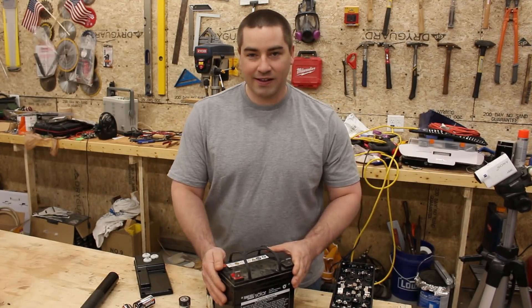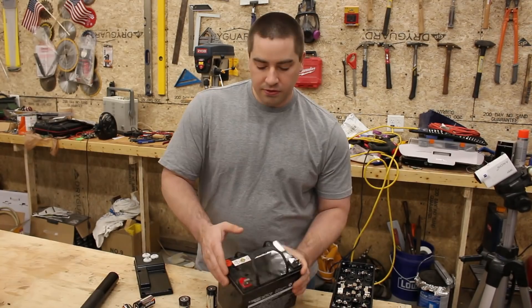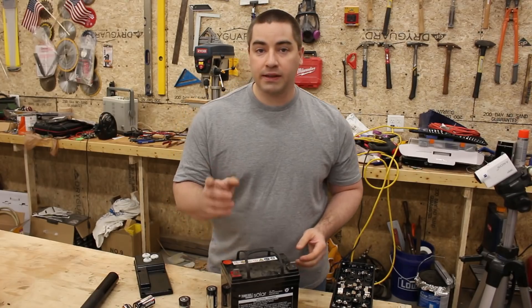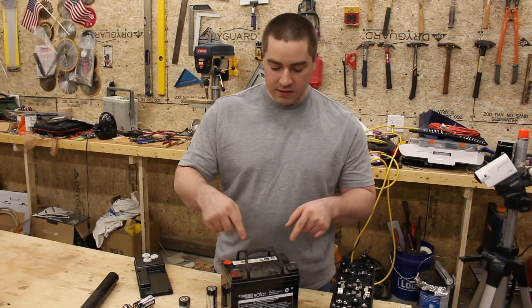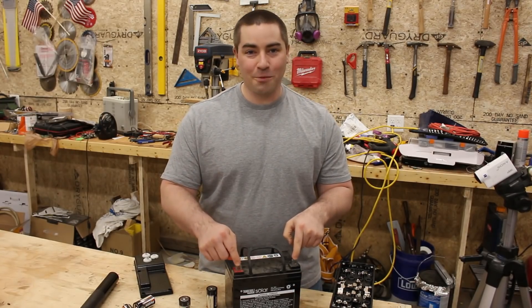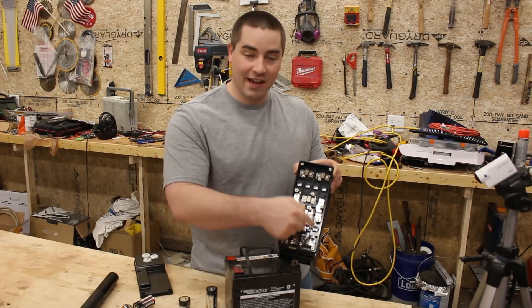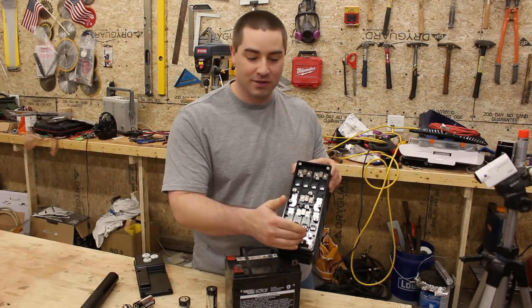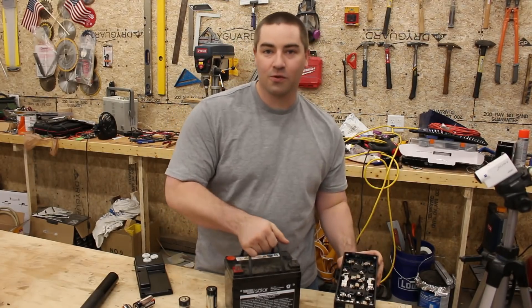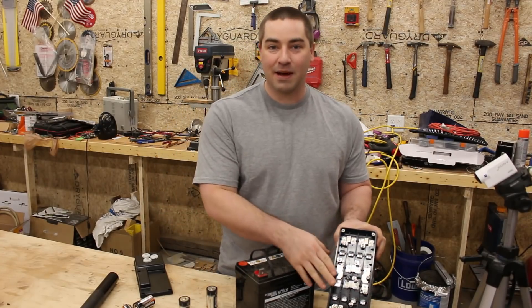Before I can talk about the really fun batteries — the lithium batteries — I have to talk about lead acid batteries, which we've had for over 100 years. It's the grandfather of batteries, and everything that we have has actually been built around the idea of using a lead acid battery. The lead acid battery is actually made up of individual cells. This particular one in front of me is a 12V, but a lead acid cell is 2 volts, which means inside this case are six individual cells strung together in series to give us the 12V output. That's exactly what they did with this high-tech LTO battery — they strung together eight cells, each with a nominal 2.3V. With the six cells of different chemistry we get 12V, because that chemistry has a nominal voltage of 2V per cell. The LTO has a nominal voltage of 2.3V.